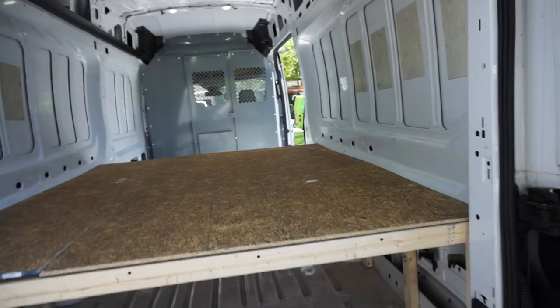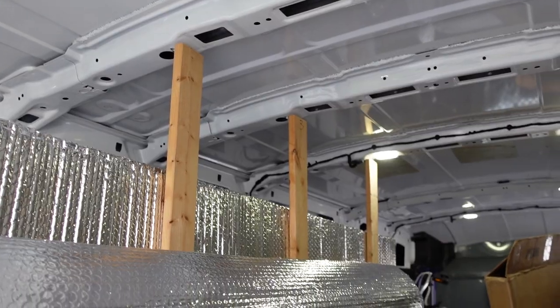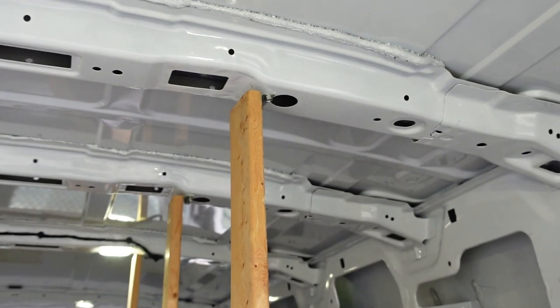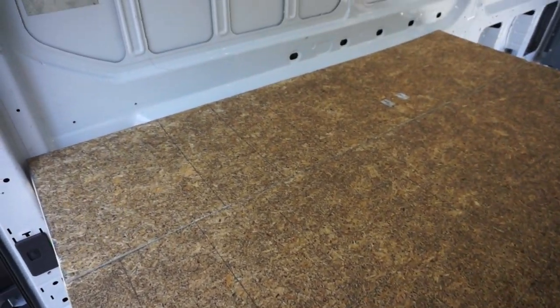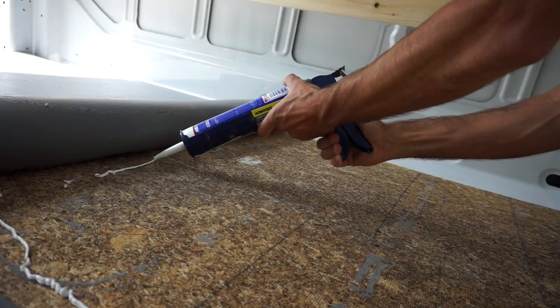So if you're building a bed or something, this would probably be your last step. But for me, I wanted to make individual sections where I can slide my pro panels and my artwork into. To create this, I added vertical pieces of 2.5x1 inch wood that created little dividers. I also wanted to make sure that my fragile artwork wasn't resting on a hard piece of plywood, so I added foam rubber padding to the top of the plywood and secured it with construction adhesive.